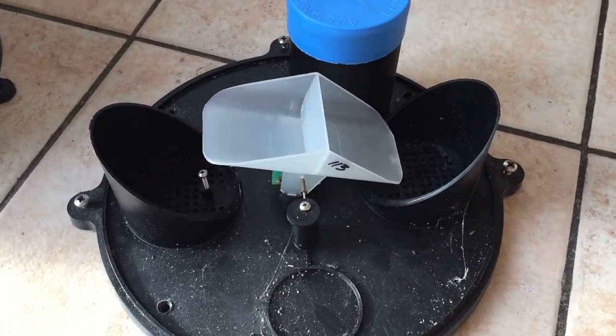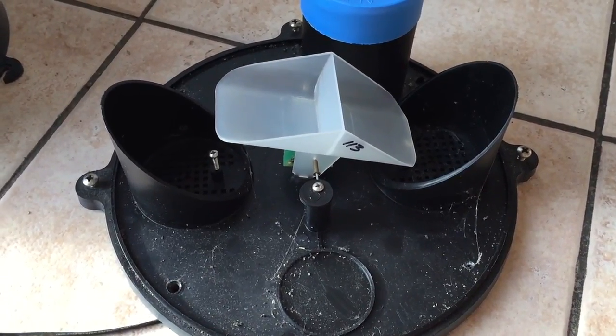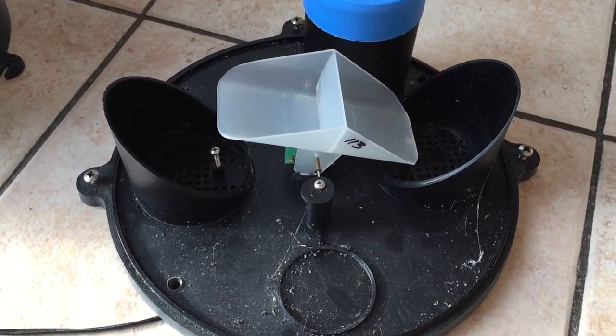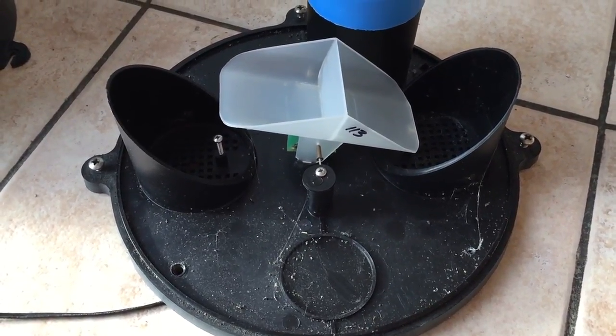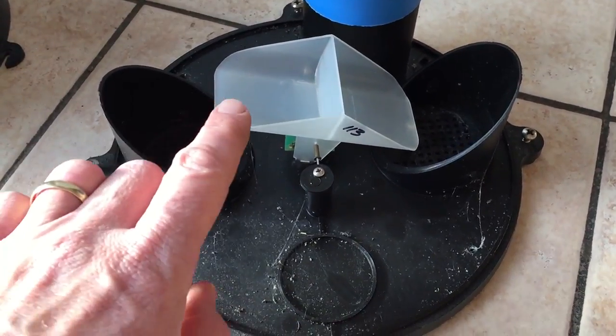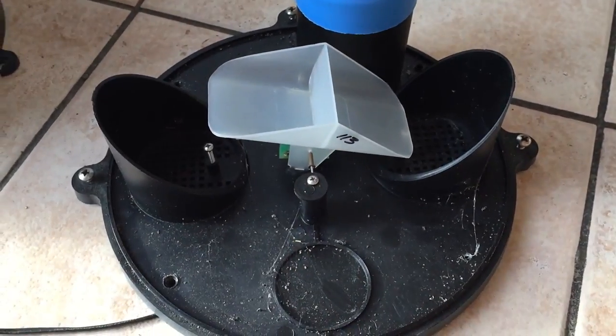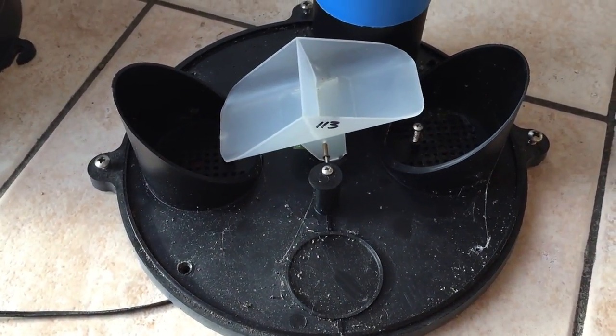This is the method I use, but I actually do have a backup manual method just in case this one malfunctions. I check it at the end of every day. So there you go — 0.25 millimeters in there tips, and another 0.25 millimeters and it tips again.